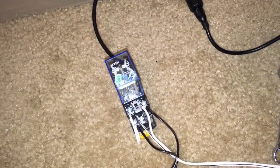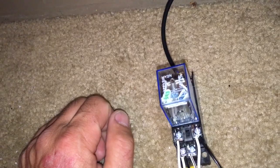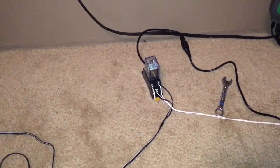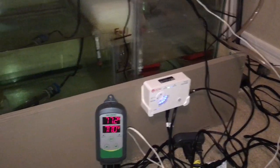The reason I'm using a relay is so that the current from my pump is not running directly in my fish tank. The pump takes a lot more current or amperage than the relay needs to excite, which is why I'm using the relay. Once I put it on a four-times-a-day schedule I haven't had any problems.